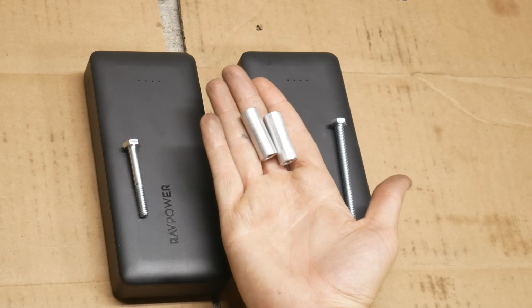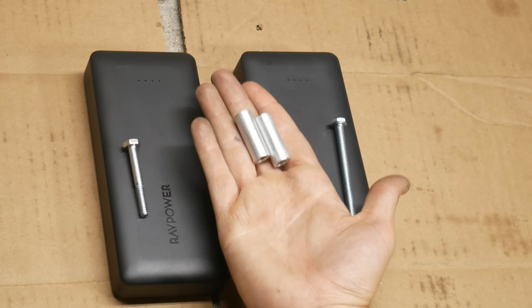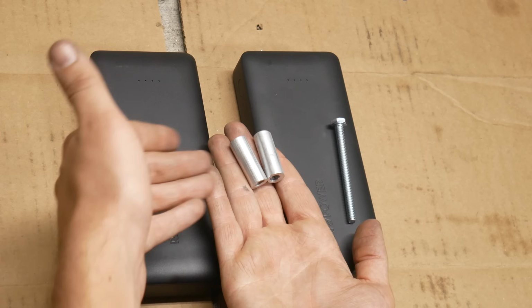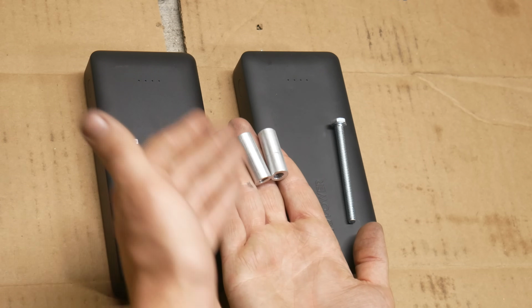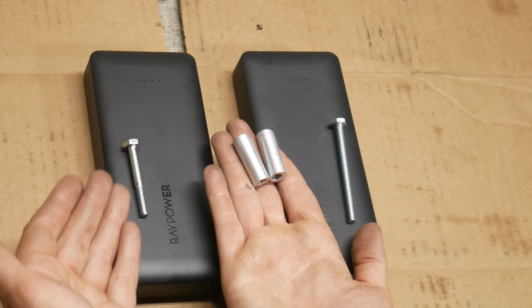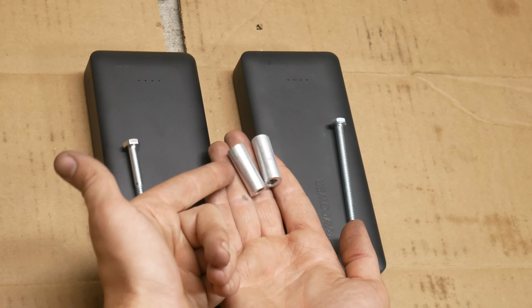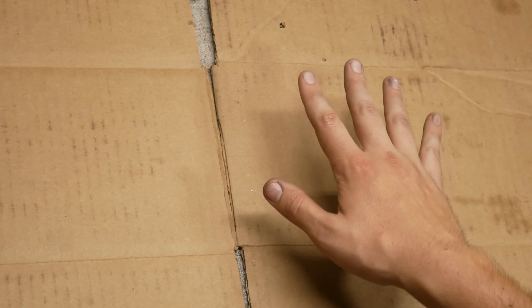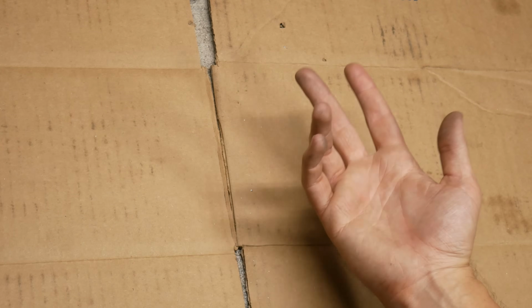This does mean that we made some of these spacers for nothing, because obviously these are going to be too short. So in addition to fitting all of the parts in the housing together and adding some slots here and there, we'll also use more of that 1/2-inch solid aluminum dowel to make longer spacers. We'll need those before we can get the rest of it together, so let's get to work making them.